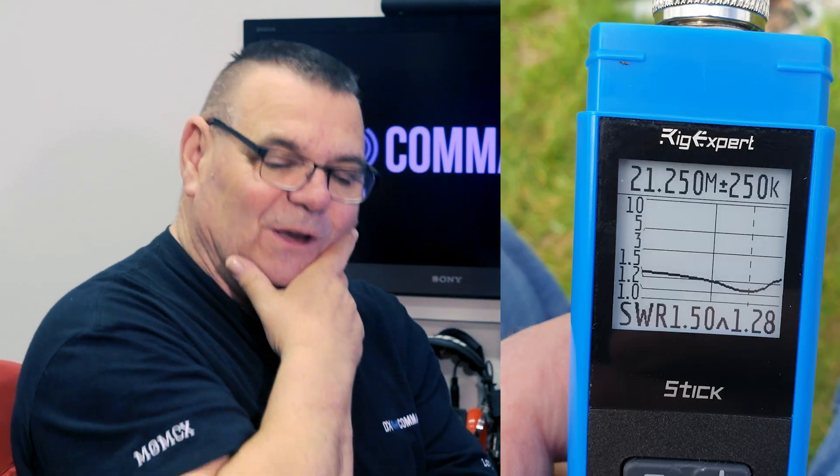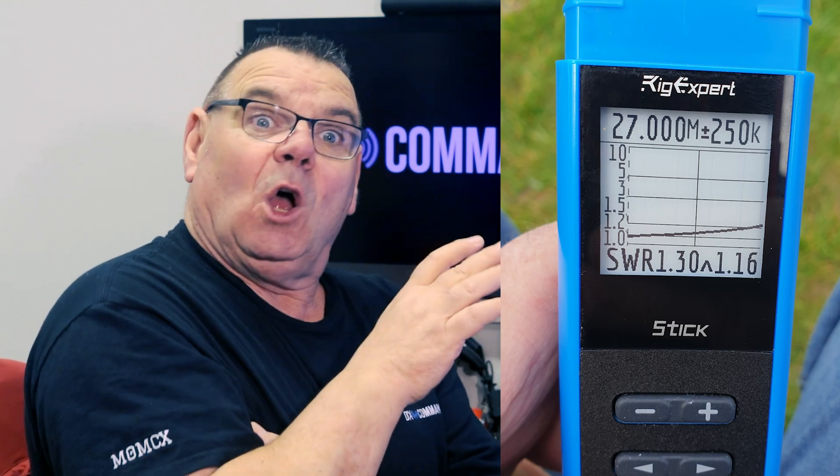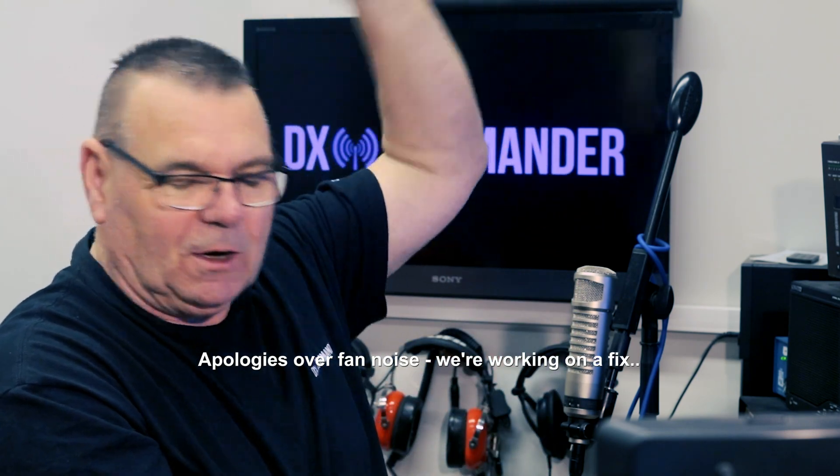15 meters is enormous. However, we've got a couple of tricks installed here — we've got a quarter wave resonant at the bottom end of 21 MHz, and then the 40 meter element gives us a bit of a three-quarter wave at the top end of 21, which is why we get some funny dips there on 21. 12 meters is fantastic — it just so happens that it glides all the way past using the 80 meter and the 30 meter coil up through the CB band. I don't know what the far-field pattern looks like yet on 11 meter CB, but I think it should be usable. Obviously if you've got a high antenna like an IMAX 2000 you'd be better off sticking it in a tree or up the side of the chimney.